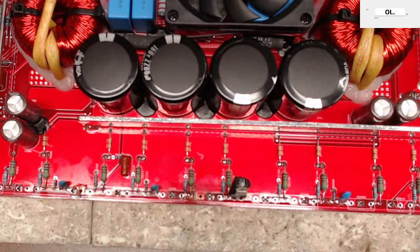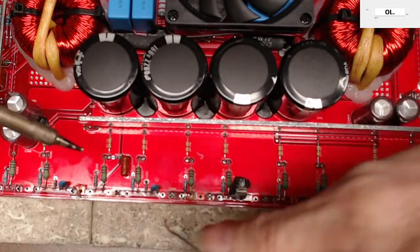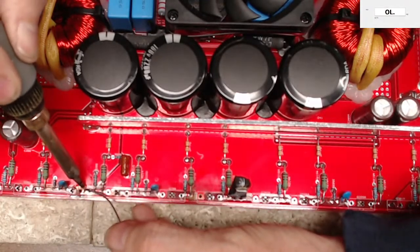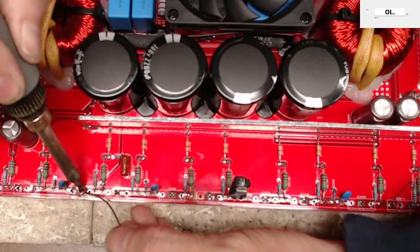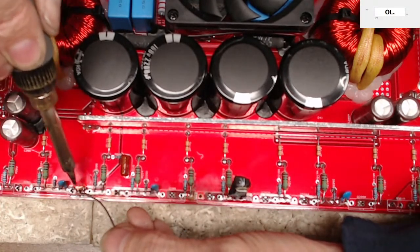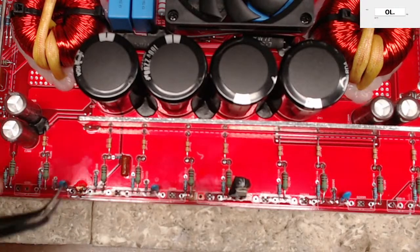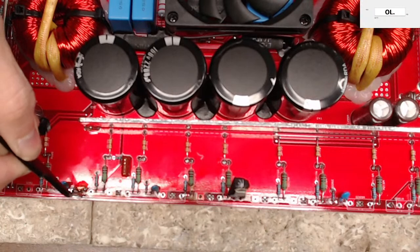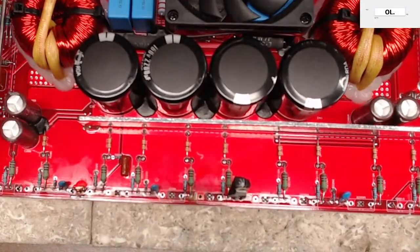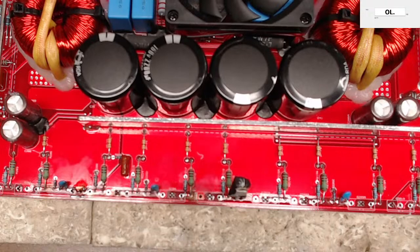And when I go to put the new transistor in, what I'll do is I will solder the trace to the leg of the transistor. Because it didn't blow the trace completely back from the transistor itself, but just a small little corner of it is missing. Which is no big deal, because what I'm going to do is I'm going to make sure that when we solder this, it's going to solder at least, it looks like about an eighth of an inch back up on the primary trace. Otherwise, all these other traces look pretty decent.